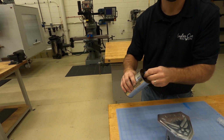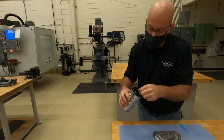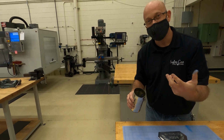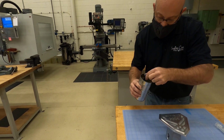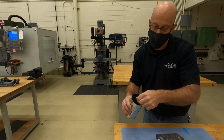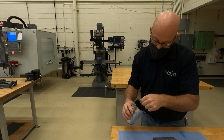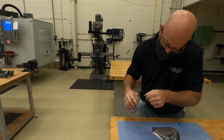How long does it take for that epoxy to set up? Full cure time is 24 hours. It'll start drying in about an hour or 2. The more you mix it, like I'm mixing this pretty rigorously, the faster it's going to dry, because it creates the chemical reaction a little quicker. I have the tines on the fork, which help mix this up. When you mix the epoxy resin and hardener, it has to be in the quantities it's designed for, a 2-to-1, or else it will never dry. Once this dries, it turns into plastic. Okay? So I mix this up pretty good.